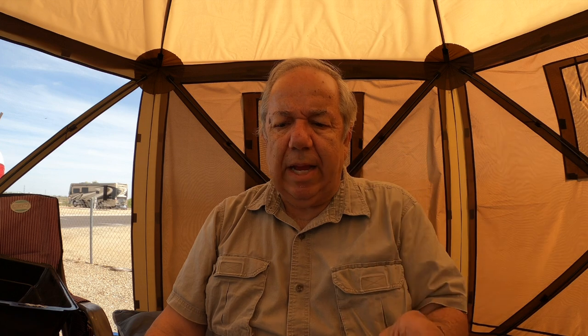I did some research and discovered that the capacitor very possibly went out. It went bad and I had my little test meter, tested it out, and I'll show you what it looks like on a bad capacitor. So it is a bad capacitor. The good news is it's only about a $15 part on Amazon. The bad news is no one in town had a capacitor and I had to order it on Amazon and it just now came in a week later. So I have the new capacitor here and I'll put it up on the meter so you can see exactly how it's supposed to look when you test to see if it's bad or not.